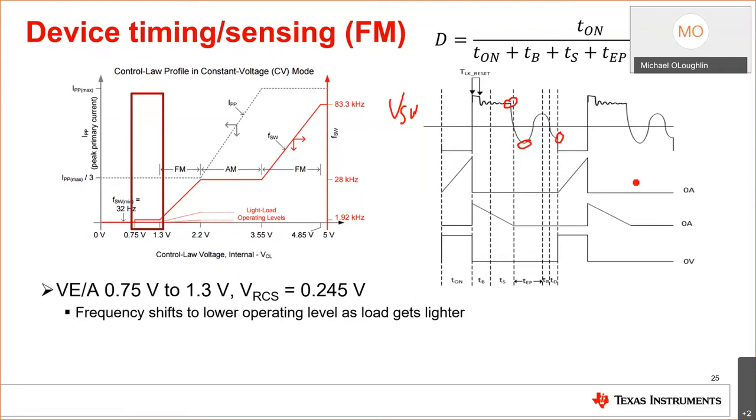Okay, any others, John? Yes, we have one more. Can you really achieve less than 5 milliwatt standby power with the snubber's RCD clamp and preload? How do you measure less than 5 milliwatts to verify? If you go to the Texas Instruments website, there's a 28730 EVM that's on the website, and it shows a standby power at 230 volts, less than 5 milliwatts. Absolutely. They can order the EVM even if they want to.